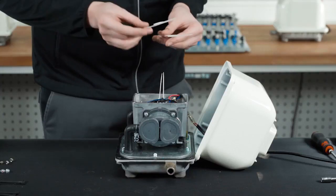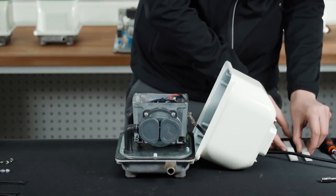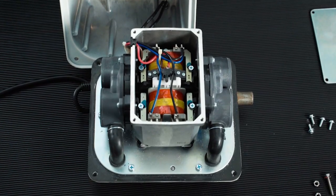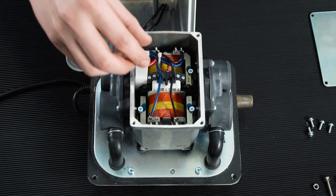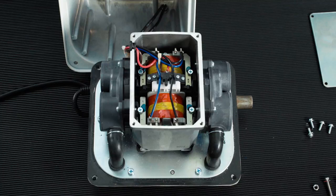Remove the spacers. It's useful to keep the spacers from the service kits for future repairs, as they aren't available separately. Reassembly. The final stage in any service is to put the pump back together again. Check it starts OK, and then put it back into your installation. Slide the magnet back into place between the two coils in the center of the core. Try to make sure the magnet is as central as possible. If you have the spacers, this will make your life quite a bit easier, but you still might need to use a flat-bladed screwdriver to gently coax the magnet to align centrally.